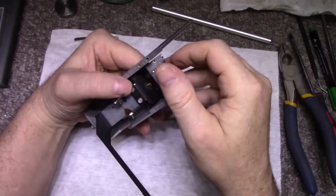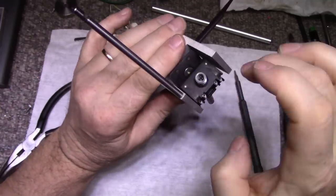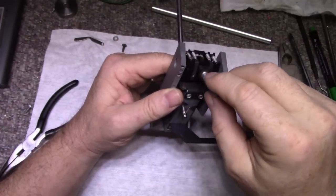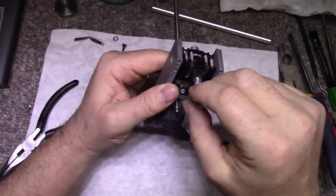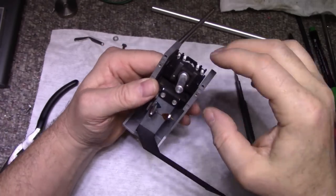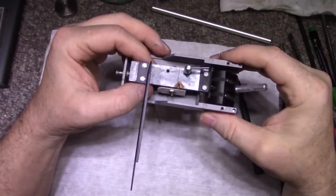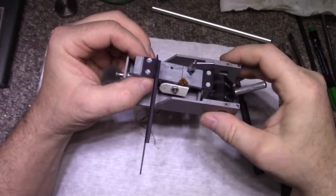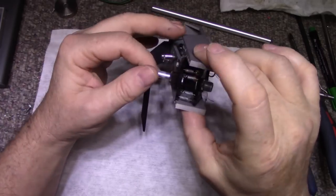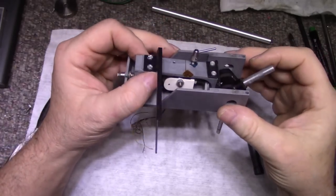And you can see how the suspension on this tone arm works. They've got four spring leafs, two of them anchored here, two of them anchored here, and then the others wrap around and come up and are tensioned with these four springs. That gives it pretty much a zero friction point. Works pretty good. But we need to get that apart. Might have to pull the wires out of it. I really don't want to do that. I really don't want to take the wires out. Oh boy.